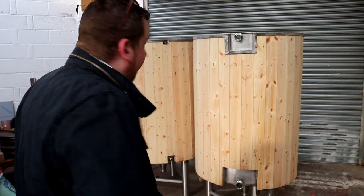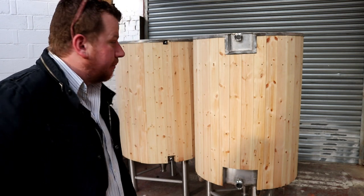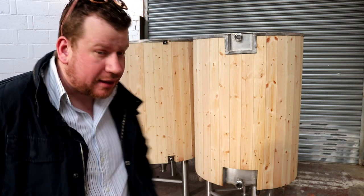But yeah, Friday tomorrow. So I imagine I'll come into work pretty early. Maybe get the inside of one of the fermenters done, so that's ready then for the treatment with the pickling paste. I won't be cladding those three until next week, but if I can get them all pickled this week, that'll be good. And then next week, oh, I need to pressure test, of course, the cooling jackets for two of the fermenters. But yeah, once that's done, I can clad them.